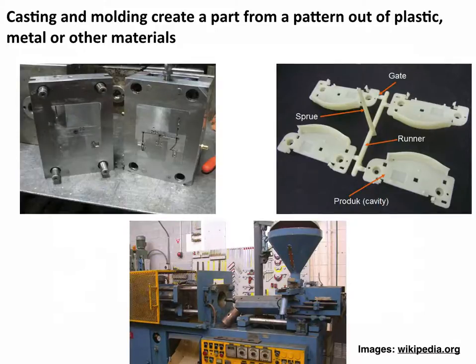There are a lot of design constraints for injection molding — you need consistent wall thickness, slight tapers so parts eject efficiently. But if you need to make a lot of something, say a special container for your experiment that's disposable, it might make sense to have a mold made so you could have thousands of containers made very cheaply compared to machining or casting each one.